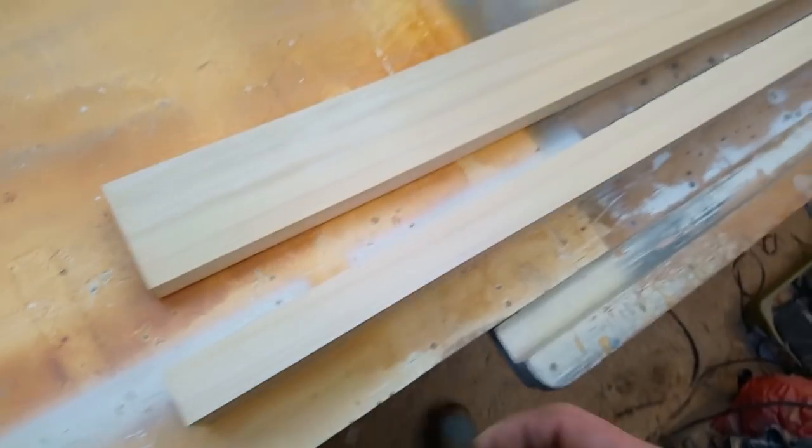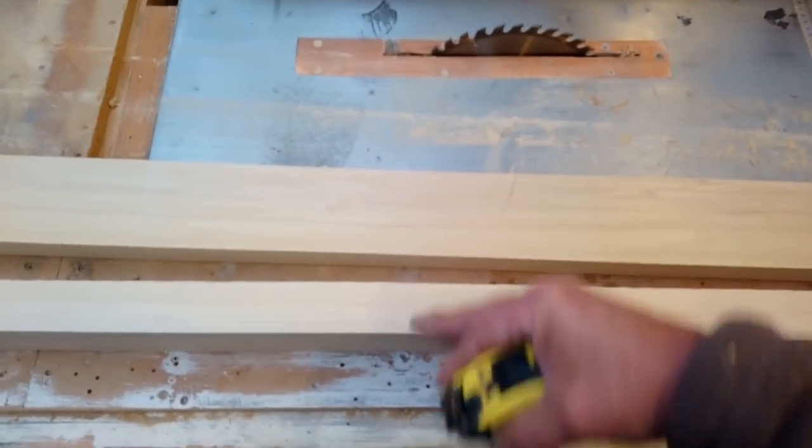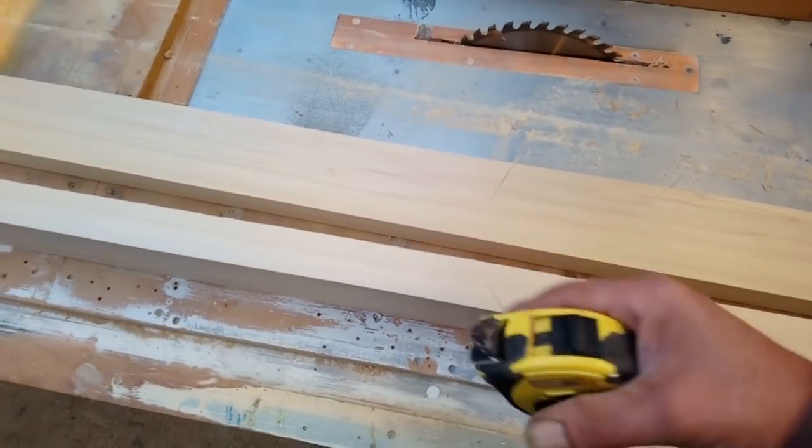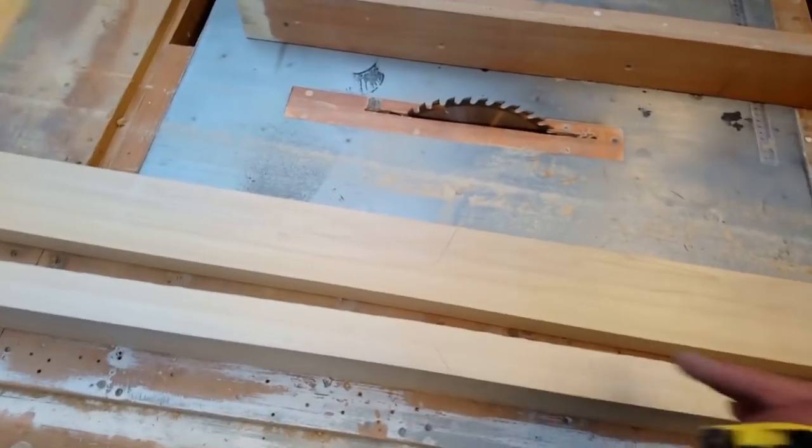got about 36 again. As you're putting it through the machine, you want to put weight on each end, but not in the middle. You don't want to bend it. You're trying to get this straight. If you push down too much, it's just going to come out the same shape that it went in.